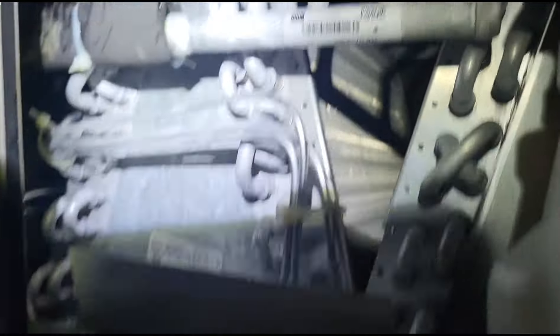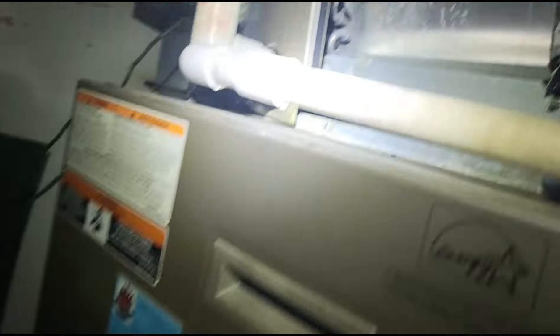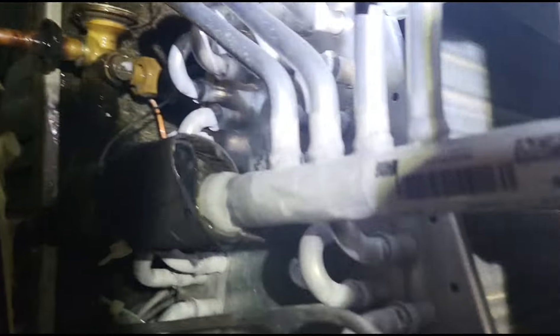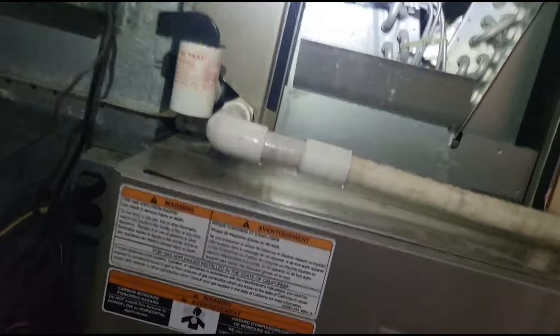This is the coil — bone dry, no oil stains, no sound. We definitely don't want to add more nitrogen. The test pressure is 450 PSI. Right now I have 400 PSI in the unit — if I go past 450 I'm basically going to blow a hole in the coil. But yeah, everything is soaked down and I hear nothing.